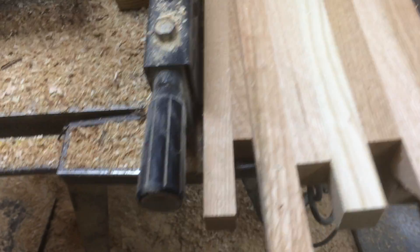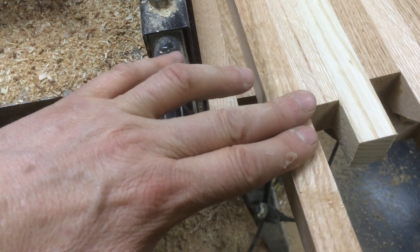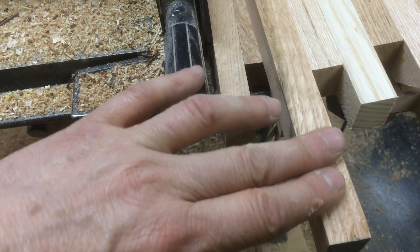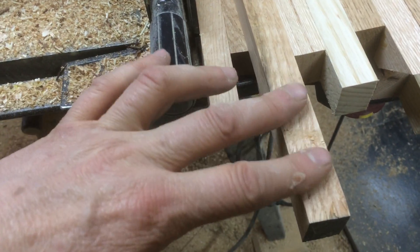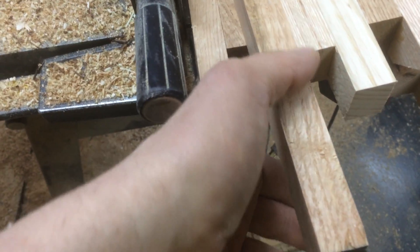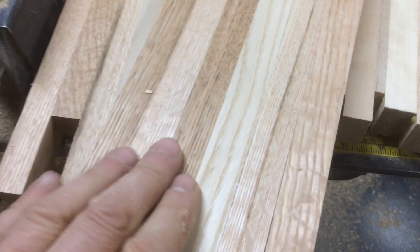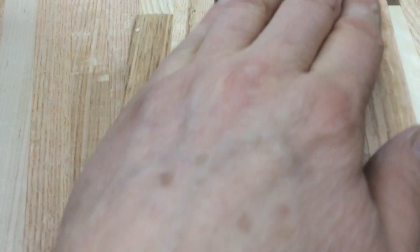I like having them longer though — you see how some are short and some are long. I like having a couple longer ones in there because that keeps the planer level as it's coming towards the end. The planer tends to dip a little bit, and that dipping is going to occur in this range depending on how I'm holding the board as I'm going through.